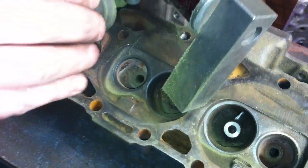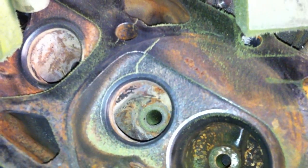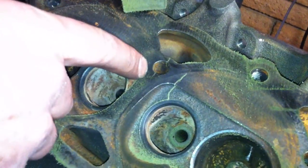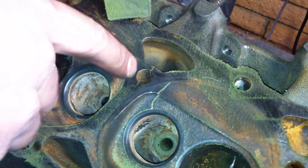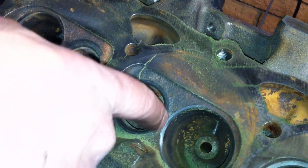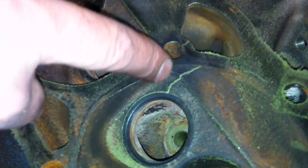And if you look there — we got a little bit of a problem here. I'm pretty sure you can see that crack there. This is our exhaust combustion chamber. And we've also got a crack right here at the bolt hole, which is not that unusual. Sometimes if they crack here, we'll actually bore this out and press a sleeve in there. But unfortunately, this is cracked from the seat. This is a truck head, so it actually has a hardened seat in here, and the crack goes underneath that hardened seat and comes out over onto the deck.